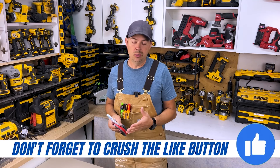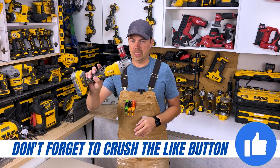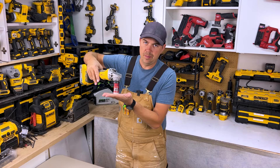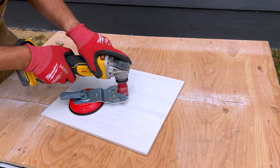As opposed to when we're not using a guide like this, we've got a setup kind of like this on a grinder and you freehand it — you wanna come in at an angle and then tip in. Well, with the guide, you're basically just starting here and pushing right in.